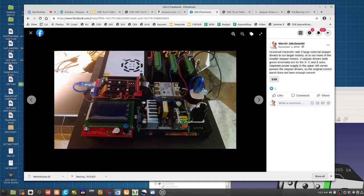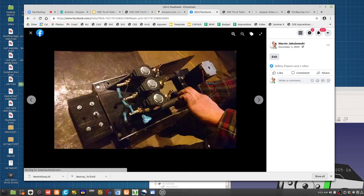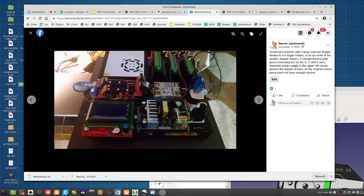So what we're going to do is one of them could control gas turn on, and there's 3 gases. We need 3 solenoids. There's 3 solenoids that are here all together on the torch head. They can be run with those 3 outputs there. You can turn on an igniter. The igniter we would turn on with a solid-state relay. The igniter is essentially like a neon light power supply, but that's a 120-volt device.